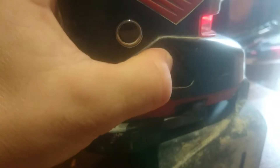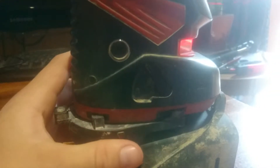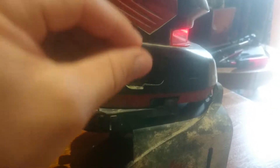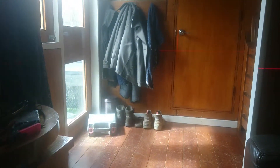You want to find the switch to release the pendulum. Most lasers have this feature, some don't. Even some of the DeWalt lasers lack this feature, but it's really good because what it does is it locks the inside to stop it from getting damaged when you're moving the laser. When you want to use the laser, you release it and then the pendulum inside can move around and self-level.